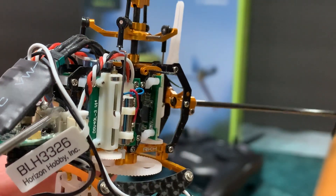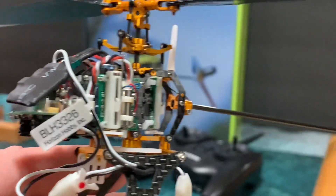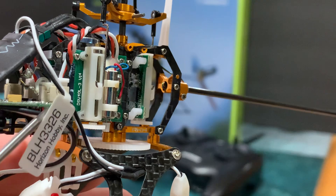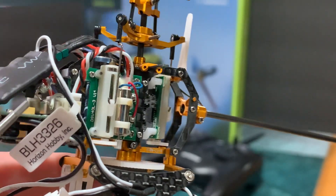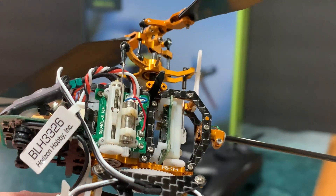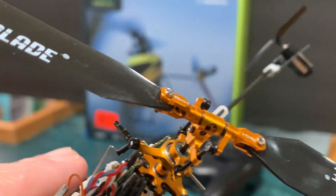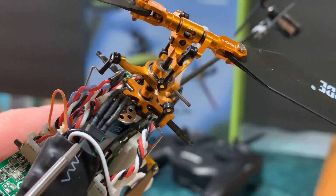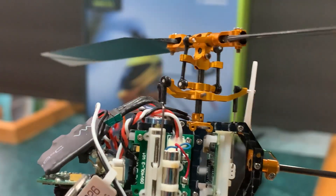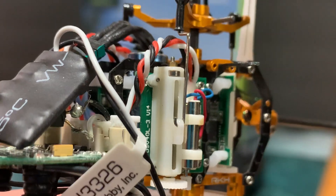That's the connector I had to modify. I basically cut this off a spare coreless brushed motor, stripped the rubber insulation off the wires, and soldered it to these two pins here for the motor slash ESC. This all goes into the ESC, and the motor goes into the ESC, then power goes back into the ESC. I had to use this somehow — I had to get it to work. My soldering is not great but it got the job done.